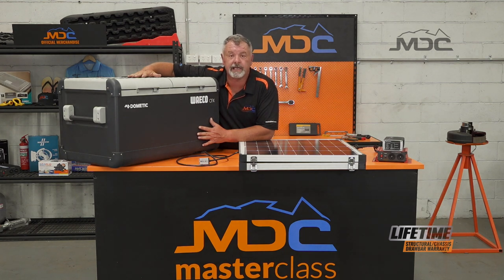If you're using a three-way fridge — which runs off gas, 240 volt, and 12 volt power — I would run that for even longer, probably three to four days before I go away, to get everything working really well. They're not as efficient as compressor fridges; they will use a lot more power and they operate a lot better on gas than they do on 12 volt, so that's something you can do to maximize efficiency.